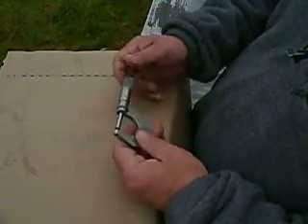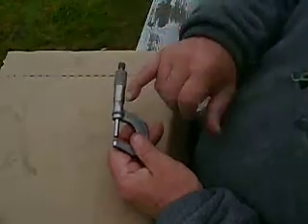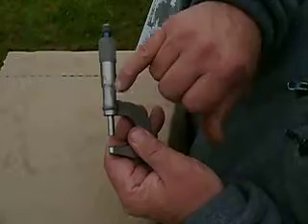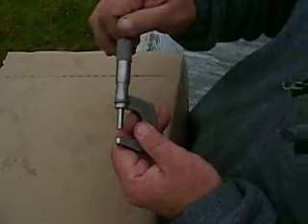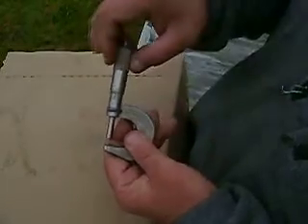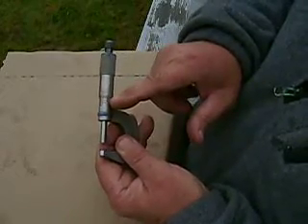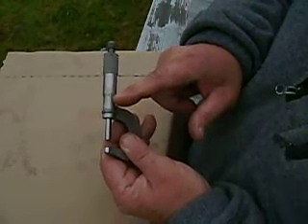This here is in tenths of a thousandth of an inch. It has three basic measuring scales. I hope you can see this, but this goes up zero to ten, and each one of these hash marks is twenty-five thousandths of an inch. You line this up here — you see this scale here — and it's twenty-five thousandths of an inch. So if you line up right at this point, it's two hundred thousandths plus twenty-five thousandths plus eleven thousandths, so basically you're two hundred and thirty-six thousandths of an inch.